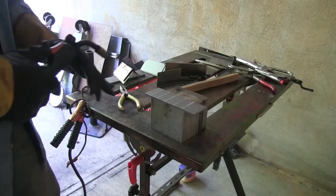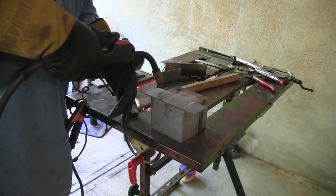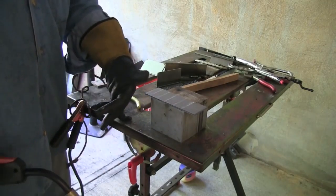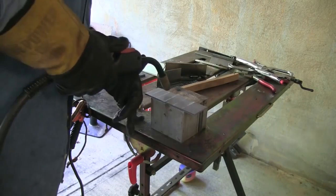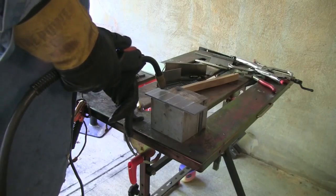Now, I always prop. I rarely weld with only one hand or with both hands even hanging in the breeze. I'm always propping on something rigid. I had a guy in class one time who only had one arm. I don't know how he made it through the class and certified, but he did. But it's very difficult to weld without a steady prop. So I prop like this, prop with a pinky, usually put a thumb or something against the gooseneck of the gun, and it helps me out. About the only way I can run a decent bead is by propping.